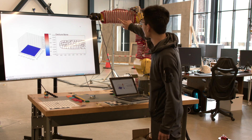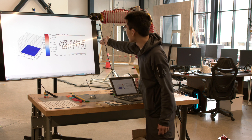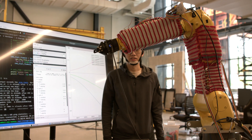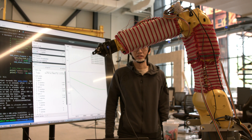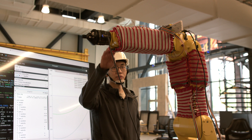The skin can accurately localize where the human contact is — it gives a location and the pressure. We can do this safety modification of the trajectory: whenever there's a touch in one direction, the robot will cancel out all the velocity in that direction, but still try its best to continue following the rest of the trajectory.